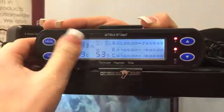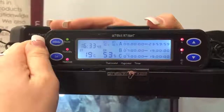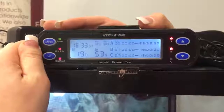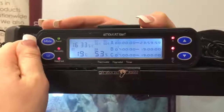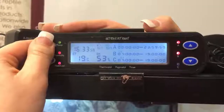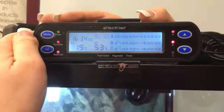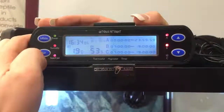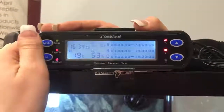Go to mode and this is our humidity — SH1 is our daytime humidity. We've set that at 90 so we can use it as a timer function for another heat light which we're going to use at nighttime. Now pressing mode again, that's SH2 — we've set that to 90 as well. Because we've got our timer on C, that's going to sort itself out.